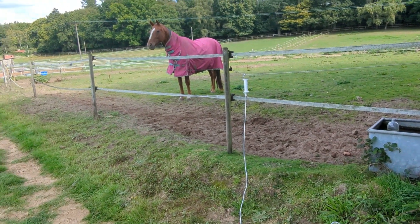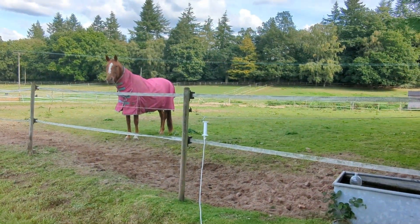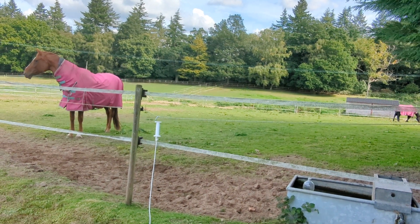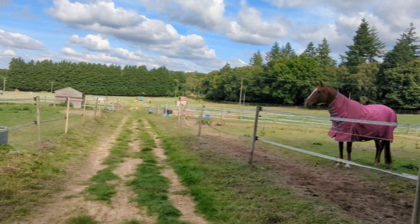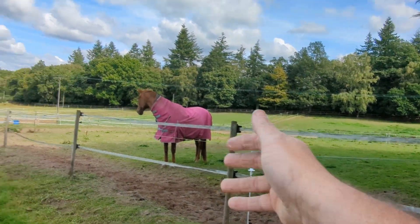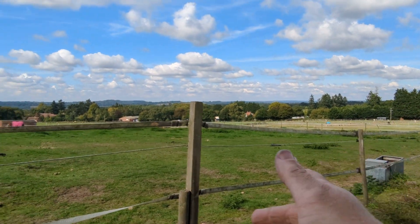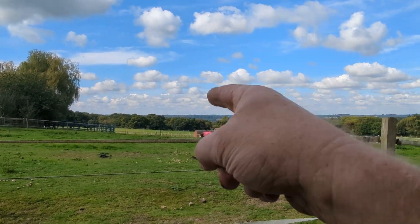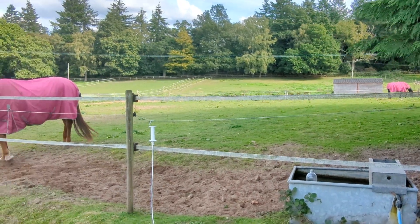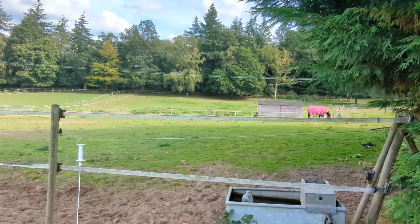By building a large fence system like this that you can isolate, you're doing what electricians normally do — giving yourself a system where you can take chunks out and narrow the fault down. We now know we've got a fault on this side; that side's fine, but the far end isn't. It turns out it's a bad jumper, or the fence has been done in a way that doesn't allow it to jump properly.